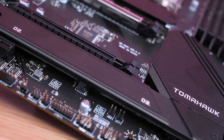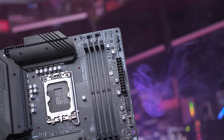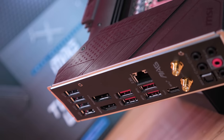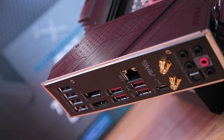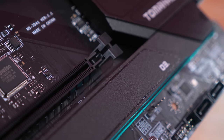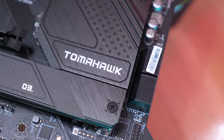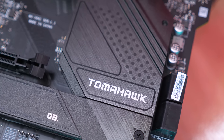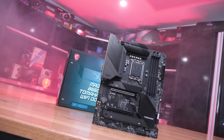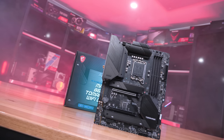For starters the B660 Tomahawk Wi-Fi gets Wi-Fi 6, which isn't offered by the Z690 model. It also packs better USB support with five Gen 2 ports on the IO panel versus the Z690's two, plus a higher quality audio codec. With full M.2 heatsink coverage and a pre-installed IO shield, the B660 Tomahawk Wi-Fi is a better board overall if you don't plan on buying a K-SKU part. High-end alternatives like the Gigabyte B660 Aorus Master are nowhere to be found, and the ASUS ROG Strix B660-F Gaming Wi-Fi is unavailable in the US. So my pick for best high-end B660 motherboard is the MSI B660 Tomahawk Wi-Fi.